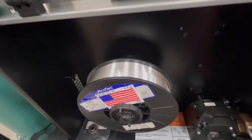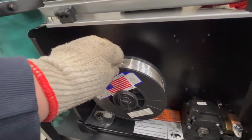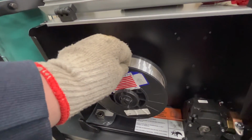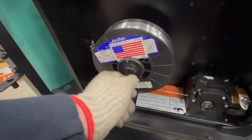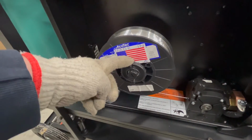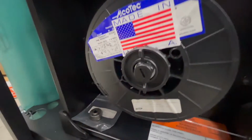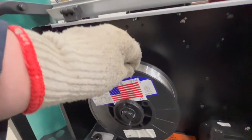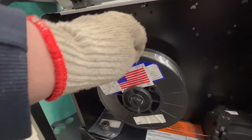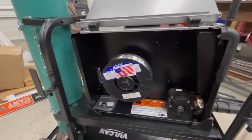One of the biggest things was that he clearly said the spacer goes on the inside, and this roll should be pretty loose. Even this, I think, is a little tight. You loosen it with that center thing there. I'm not going to move it, but you tighten this big nut up. This little guy here with the little indent for a screwdriver, you move in and out until it's pretty loose. I know it's hard to tell. Okay, so that was a huge mistake I made.